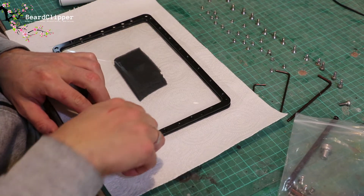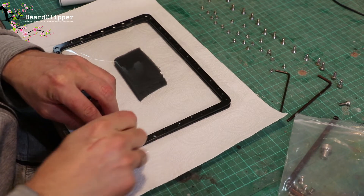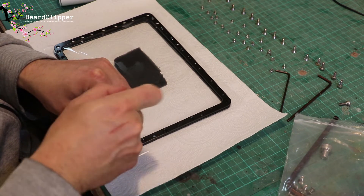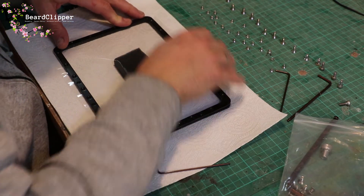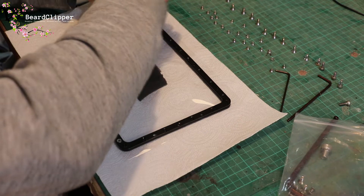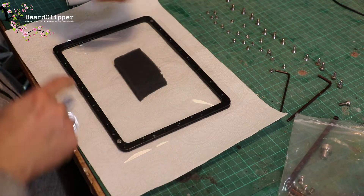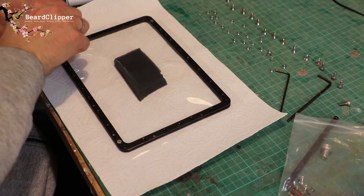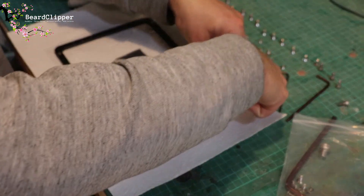What you then do is come along and punch the screw through — you'll hear it kind of make a noise. Once you've done that you can tighten it up. This is an iterative process. You need to be very careful not to damage the FEP: if you slip and go through, you will put a hole in it. I don't tighten up very much at all at this stage — I do alternate corners just to get it held in place so the whole thing is not moving around. Put one here, not too tight, then one in this corner and then that corner. Once you've got those in, you can fit the rest in whatever order you like, but it is a good idea to do the four corners first.